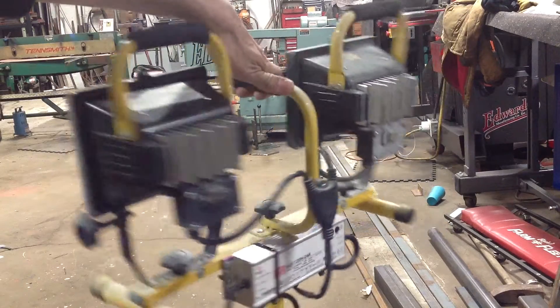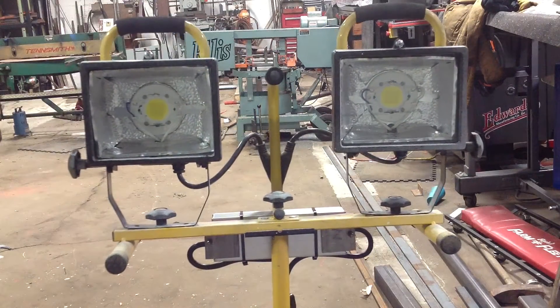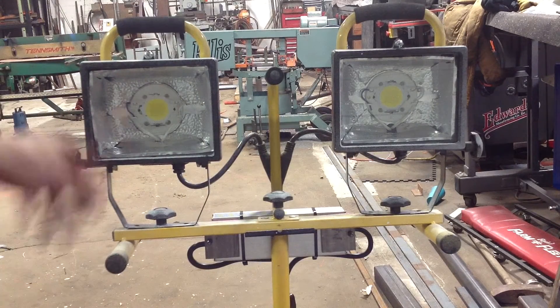The chips I used are 24 volt, 5000K, 5300 lumen chips. It's kind of nice that they have housings so they are easily replaced should they fail. But like most LEDs, I think it's 50,000 hour run time. I did reuse the reflectors and cut those to fit and epoxied those all together.